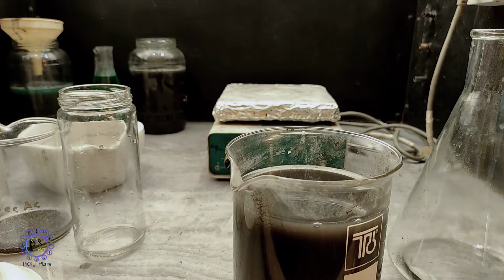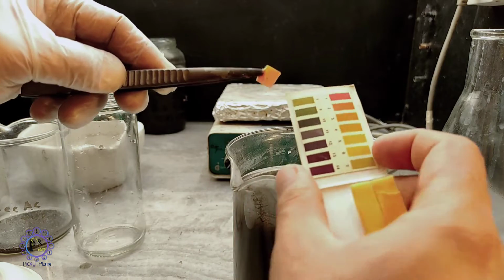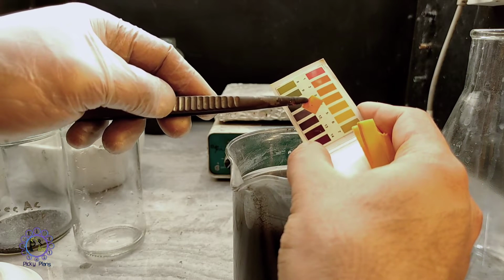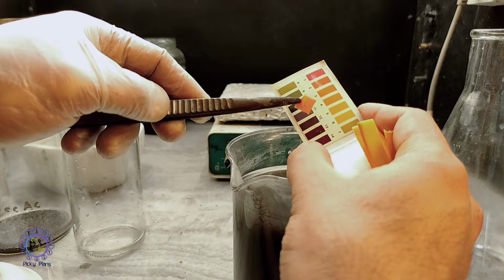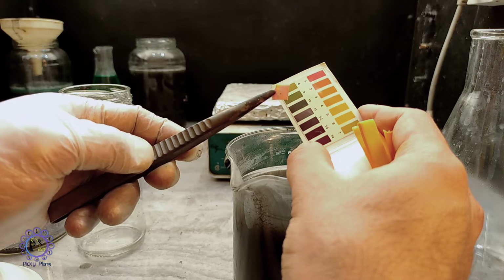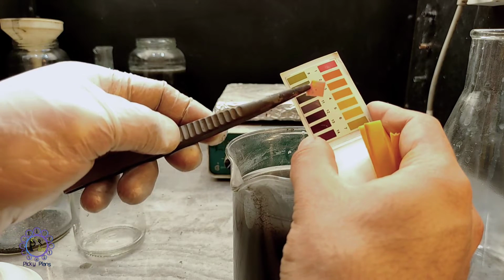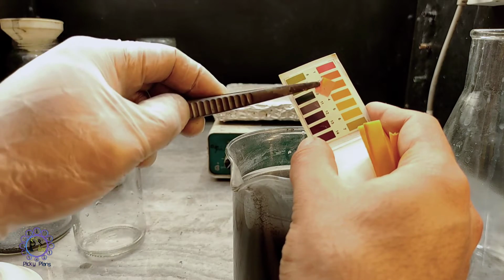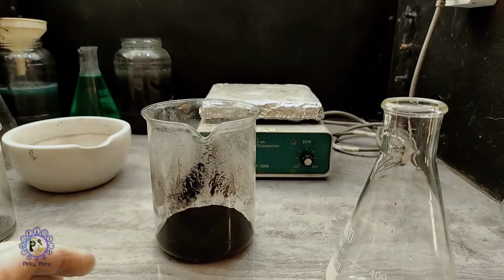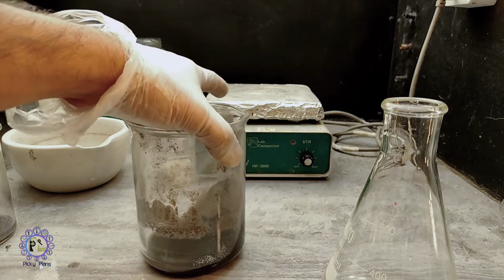After treating the ashes twice with nitric acid to dissolve base metals, we need to wash it properly with water to get rid of any base metal that has been dissolved. So we need to reach a pH around 7, that is neutral pH. That's how we understand that there are no proton ions and also no metal ions. When adequate washing is done, it's ready to treat with aqua regia.